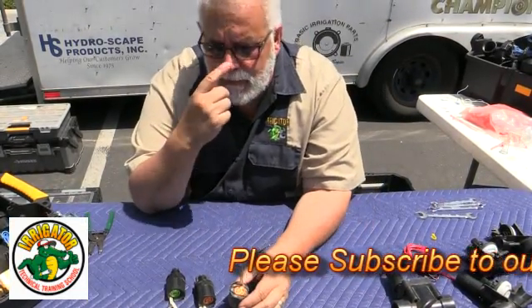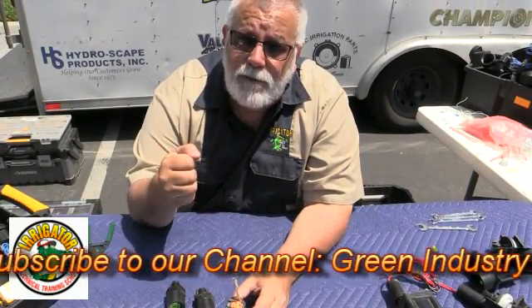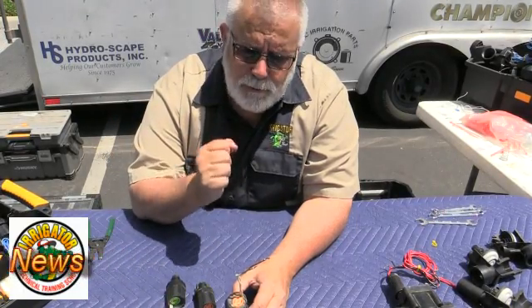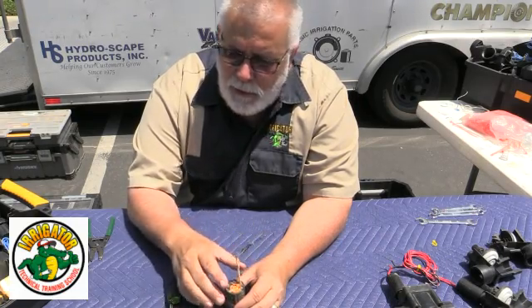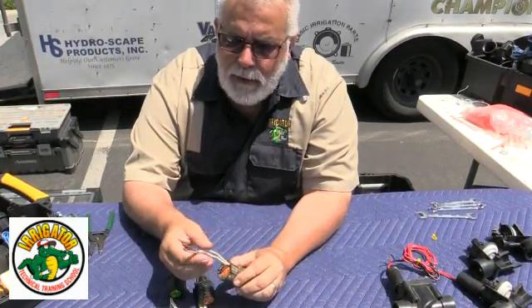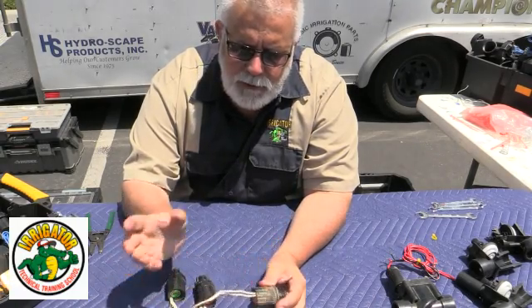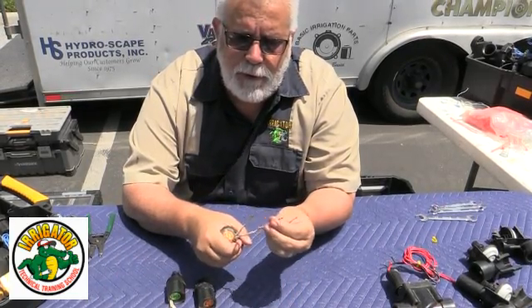If you get a valve that sticks on, and you go outside and shut off the isolation valve — whether that's a ball valve, an angle valve, or a gate valve — and say, 'I'll fix it this weekend,' but it's now Tuesday: make sure you go into your garage and turn off the timer. Because if the timer keeps coming on for this station, or any of the stations, every day for 10 to 15 minutes with the water shut off, you're going to see burnt marks on the solenoid, burnt marks on the wires, and all the other valves will start wearing out — and all the solenoids will start going bad within the next six months, if not sooner.